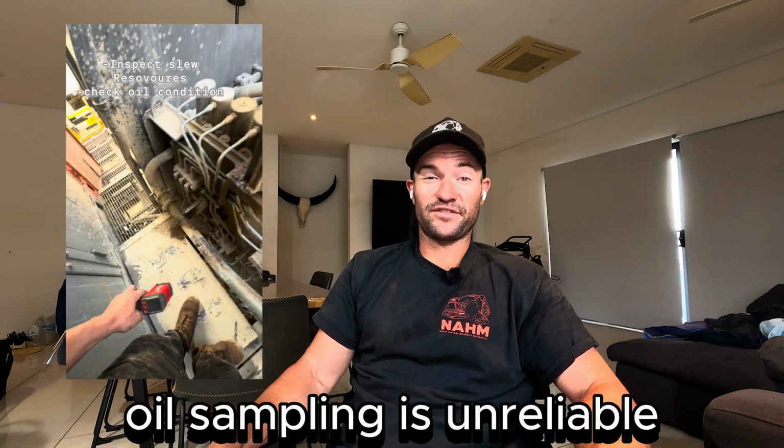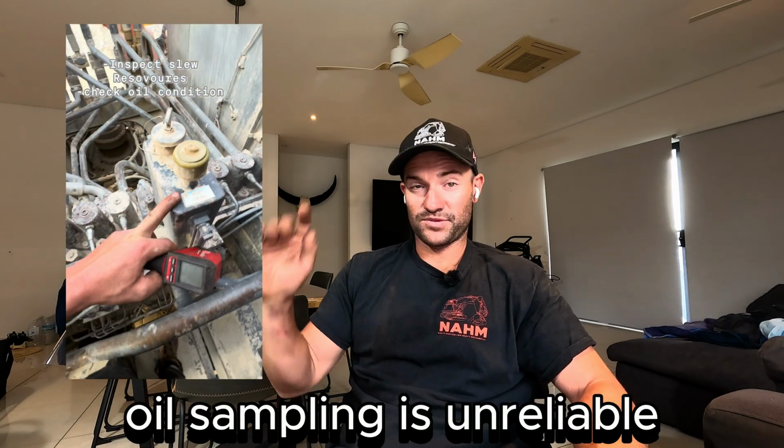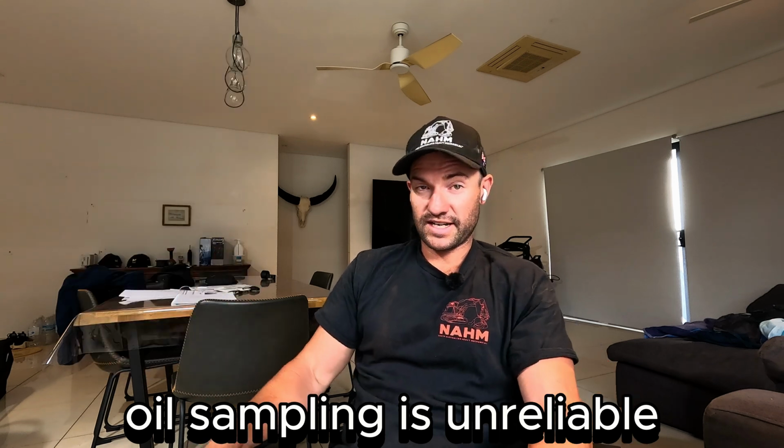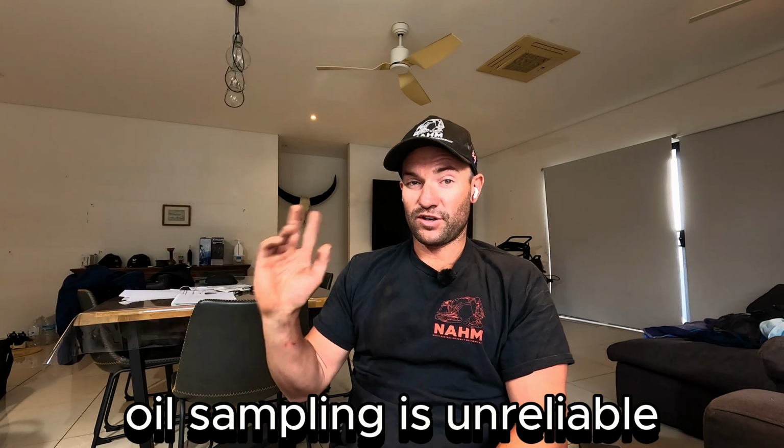So some other complaints that you'll get with these systems is noisy slew. Now, to start off with, it's just visual checks. So go and check your oil reservoirs and look for burnt oil. I think, from my experience over the years, oil sampling is a complete rort, and it's never identified a failure before it's happened. It just depends where the person's taken it from. They might have taken it from the service hatch or anything like that, and they'll just often tell you, "I'll sample and resample and change the oil." So that's why I always refer back to the oil reservoir. Never worry about the oil samples.